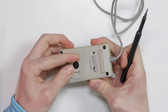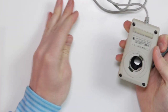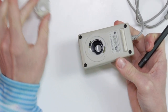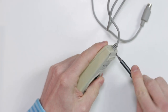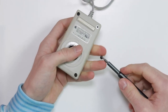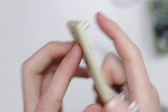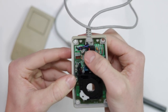We'll start by taking it apart. This mouse operates using a ball, so we can go ahead and take that out. It's not a bouncy ball unfortunately, which is a bit of a letdown. This little cap piece can come off now — that just screws in and out really easily. That's probably to remove the hairs and stuff which this would have most likely collected. So we can go ahead and take out those four Phillips screws. You can see that's the little piece which is going to be registering the button press, and then there's the switch in the centre.